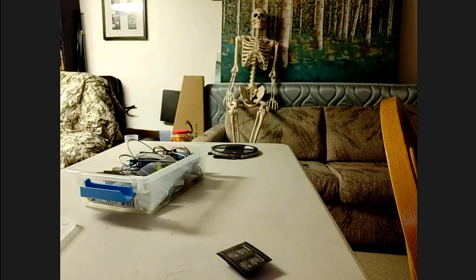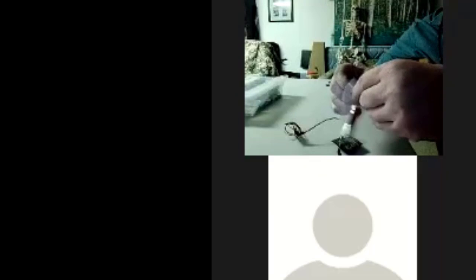Okay. Now, if I share my screen on the laptop, these are the controllers. They're about the size of a postage stamp. They have an 8-pin header on the back. And I'm going to plug them into two other devices to get this job done. The first is a programmer. And there really is nothing to it except that it's a USB to serial adapter.